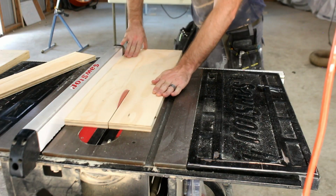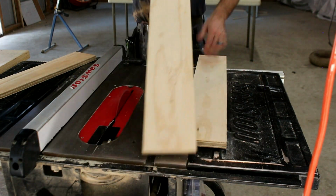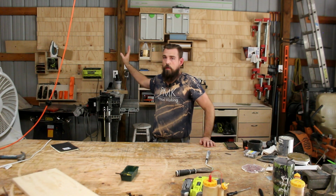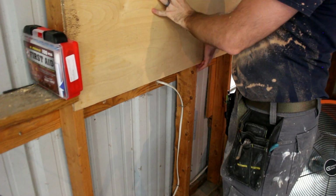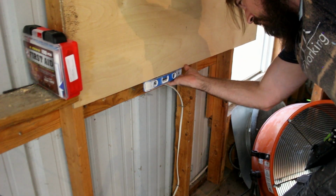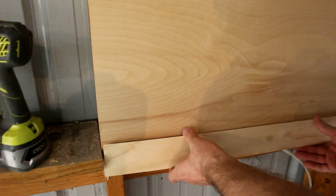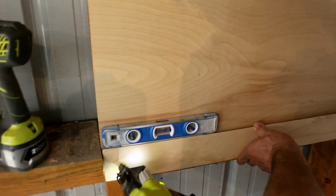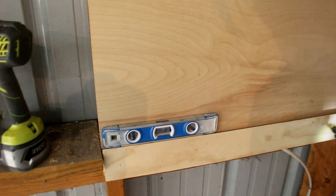The way I did this was to make a 7-inch template out of plywood. I basically just cut one big long strip from scrap wood I had sitting around the shop. To start, I went ahead and put the pieces on the wall and double checked them to make sure that they were perfectly level. Once your big piece is level, everything else will just fall into place. So to start attaching the pieces, I lined up the bottommost piece with the bottom edge of the plywood, double checked it again to make sure that it was level. Once I was sure that it was level, I added glue, I added brad nails, went ahead and tacked it directly to the plywood and left it to dry.